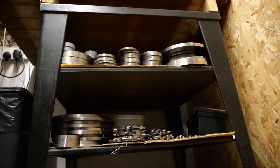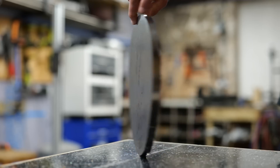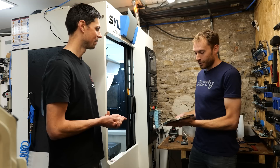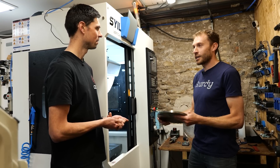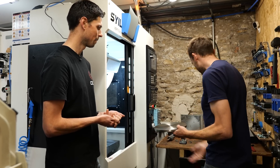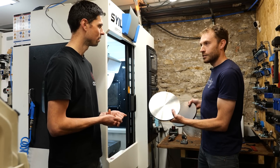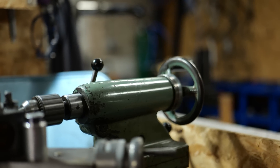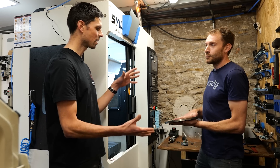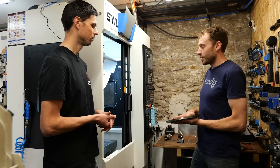What do we start with? What does the piece of material look like? We're going to start with a bit of — a giant wedge. Yeah, basically it's titanium bar stock. So this was part of a big long bar, it's about 250 millimeter diameter. We get it in in a version of this form. It'll either be saw cut or this one you can see has been turned — someone has turned that on a big lathe to get the surface down to the rough height that we need. So that's like giving you your base starting shape. Yeah, so the actual raw material would have looked different to this, but this is how we're going to start.